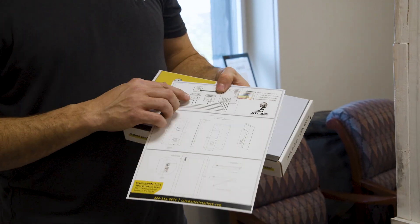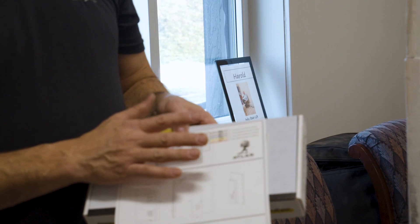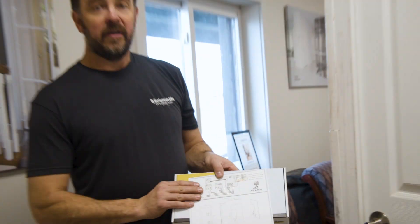What's different about the wiring from any other interlock is that this does require 24 volt and ground signal at all times. Because of the way the interlock latches and unlatches, it doesn't use a spring or a solenoid — it uses a linear actuator which requires power even when there isn't a signal going to the actual unlock or solenoid signal. The black wire and the white wire supply power at all times. The white wire is your plus 24 volts, the black wire is ground. The remaining wires will be your typical interlock wires, and the color coding is pretty typical as well.